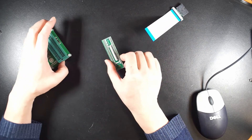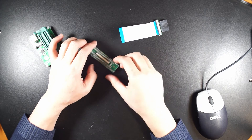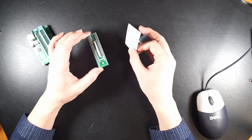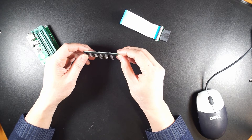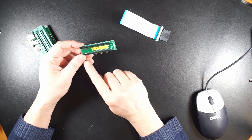I have seen people have some issues using this board and they have questions I'm going to answer here. When you purchase this from eBay or AliExpress, they come with a bare board as well as two rows of pin headers without soldering. You only need to solder the 24 pins on each row.